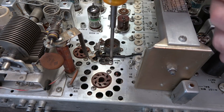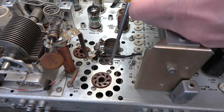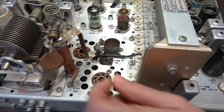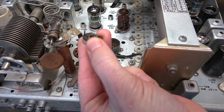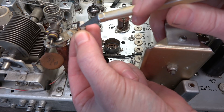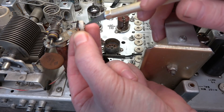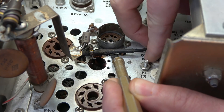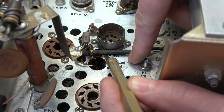The cap is desoldered. Check out how badly it arced — I can already see some arcing to the chassis. That was probably the resistance path that was screwing up that negative bias. There it is, Mr. Charcoal. If you look right there, you can see what appears to be corrosion — some white junk in here. Probably arcing between the ceramic and the Phenolic to ground. There's also arcy sparky evidence on the coax coming up underneath. I'm going to clean that up and inspect the coax to make sure it's not damaged.